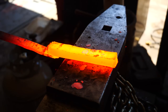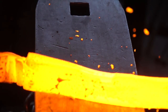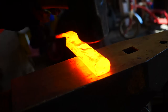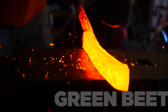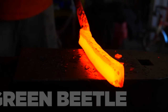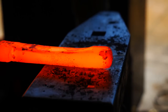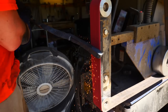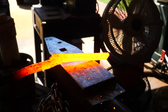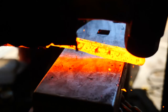Canister two is much more solid under the hammer. There are more drill shavings than in canister one and better packing with the powder, so I'm hopeful that we'll get something a little better to work with and that we'll still have an interesting pattern. It is sort of teed out, so I ground off those edges — which are just mild steel — and then we'll hammer it back a little bit round and then flatten it some more.